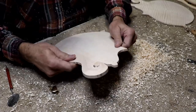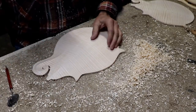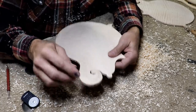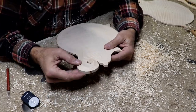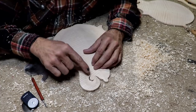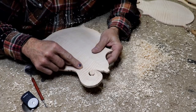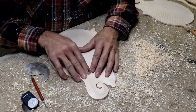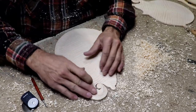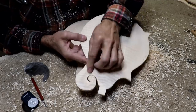I really like that now - I'm glad I took the time to do that, it just feels so much better. And now I guess we'll scrape it again. I'll pick up my scraper and rough scrape it with this and detail scrape it with this. Just one more thing I wanted to tell you about carving is this scroll. The scroll doesn't really make much difference in terms of sound - it is pretty much just a decorative feature and a beautiful feature. This is your high point, and you just want it to continually come down and come down and then just drift out into nothing. I re-carved this whole thing this morning as well because it just came in too high into the body up here. So I carved it way down and I like the look of it now - it's got a nice taper all the way down.